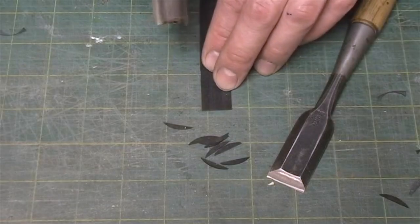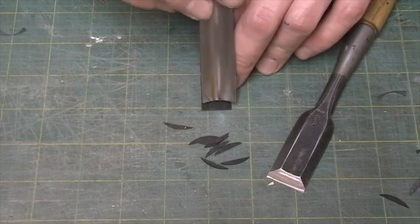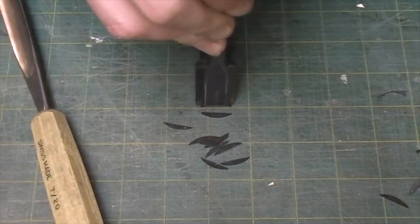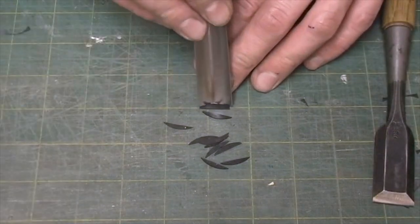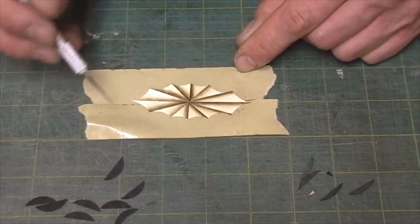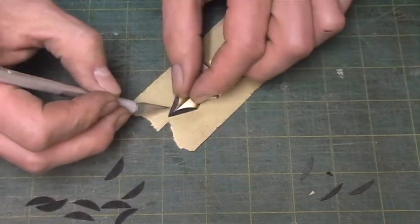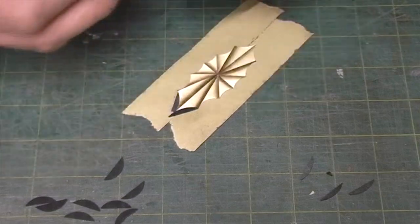Now I'm going to cut the scallops to fill in those ends from a piece of black dyed veneer. I've cut the veneer just a little bit narrower than the width of the chisel so I don't get any splitting at the ends. I'm going to place the gouge so I have sharp points at the ends of each little segment — that's important for the next step. Between each cut I'll square up the ends with a chisel, making some with the number 7 gouge and most with the number 8. The two at the top and two at the bottom need to be trimmed ever so slightly to fit, making a little cut so they come up to a good sharp point.